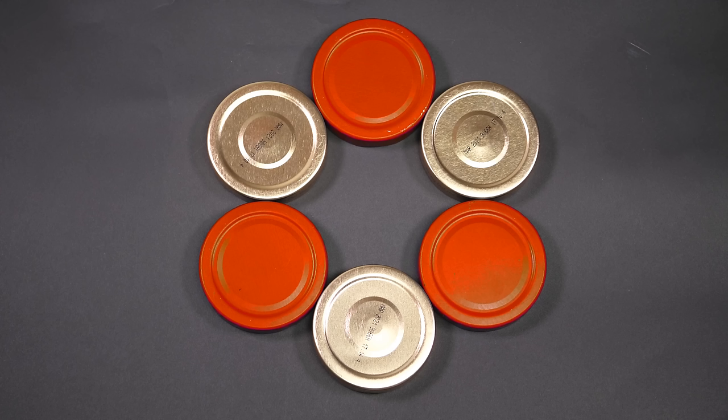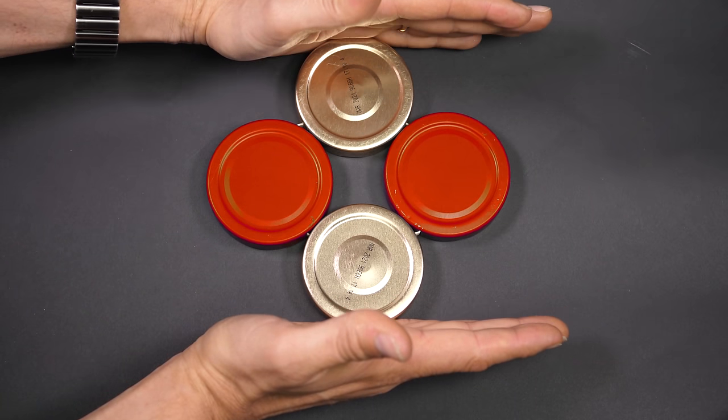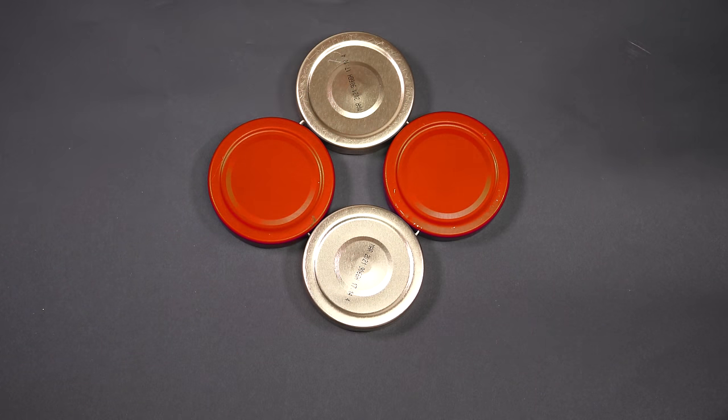The second criteria is more subtle — it's to do with symmetry. The crystal needs to have a certain type of symmetry, or more accurately, a lack of a certain type of symmetry. Take a look again at this hexagonal arrangement of atoms from the quartz crystal. Look at this silicon atom, then draw a line through the central point to the opposite side — it's not another silicon atom, it's an oxygen atom. So there's something different on the opposite side, meaning it doesn't have point symmetry. To see why a lack of point symmetry is important, look at an arrangement of atoms that does have point symmetry — silicon atoms opposite silicon atoms, oxygen atoms opposite oxygen atoms. When you compress that crystal, you move the charges symmetrically, so the average position of those charges doesn't change. It stays in the middle.